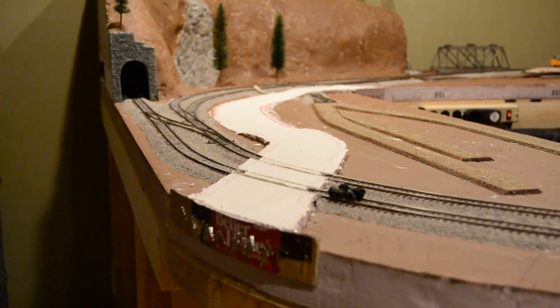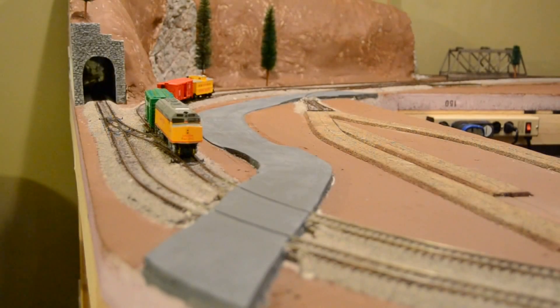We've let this dry for a few days — it took much longer to dry than expected. Since we're not using the sheetrock mud as specified, there are some considerations there. Basically, it would dry, it would crack, we'd fill in those cracks with more sheetrock mud, let it dry, crack again, and we redid that process, sanding between every application. We now have a road we're going to be able to live with.